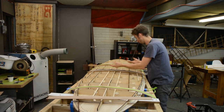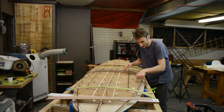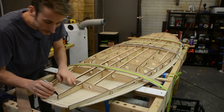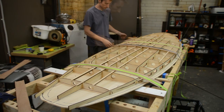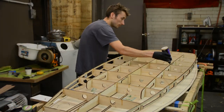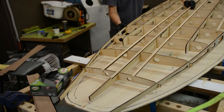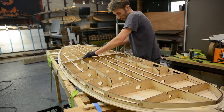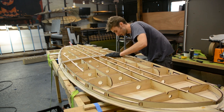That's the dry run completed and it's looking really pretty good — there are no major gaps except for around one area, which is a position we could probably reach a clamp into. With all of that fitting quite nicely, I'm just going to do some witness marks, then we can get onto the glue-up. I'm going to undo all the straps, flip the frame over, put glue on all the faces, and then just press it into place. Now with glue on everything I'm flipping it over carefully and lining it up with all the marks we did before, starting from the middle out as I apply the straps — checking that our registration marks are actually lining up.